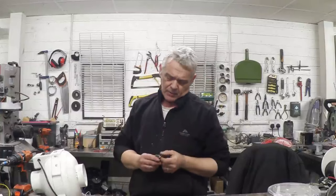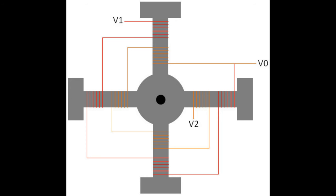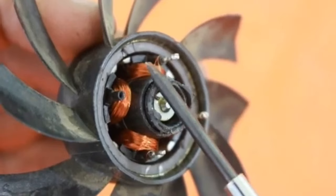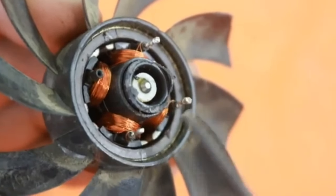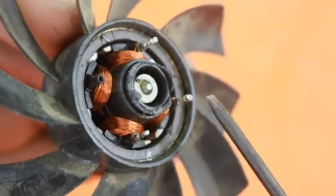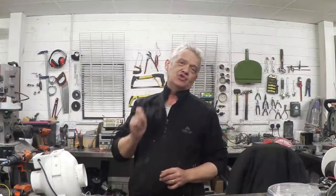To remove the stator, you just twist and pull it off, and you get the stator piece with a circuit board. What we're really interested in are the coils — and there's only three: L1, L2, and L3. L1 and L2 are the beginning and end, and L3 is where two coils are joined together. Sometimes it's written on the board; sometimes you just have to look and you'll see two wires going into one leg — that's the one you don't want. The other two legs have one wire each, and all you do is solder onto those legs, stick the whole thing back together, and instead of a fan you now have a generator.